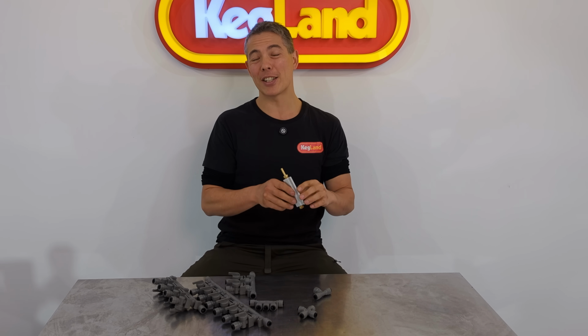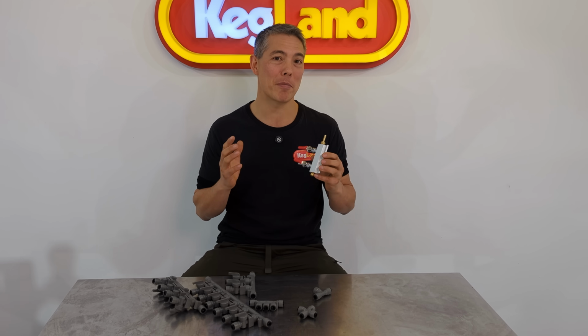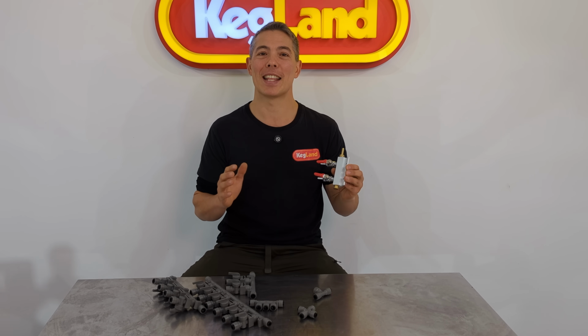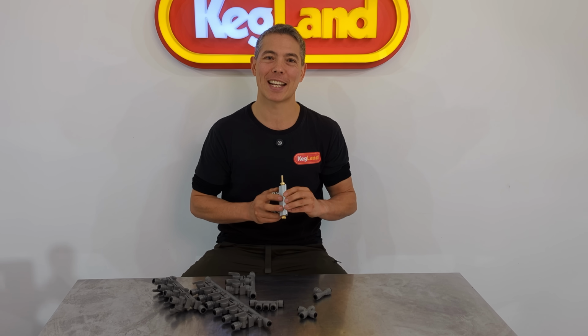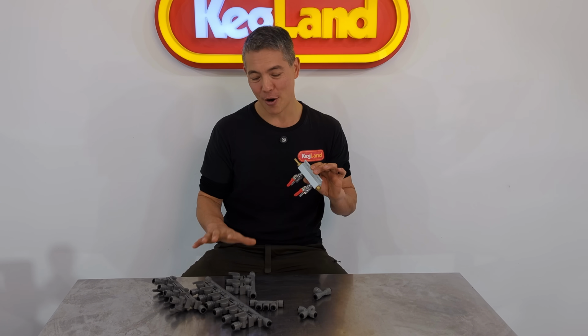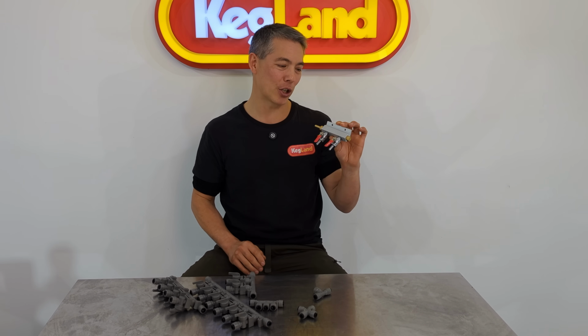The other thing is screws are not exactly an ideal mounting connection type, because inside a fridge, we see it quite a bit. People screw these into their keezers or kegerators or whatever, and then they start puncturing things like gas lines or electrical cables inside the walls of their fridge. And it's very, very hard to know exactly where they are. So we've got another solution with that on these new Duotight fittings, which I'm going to show you in a moment.